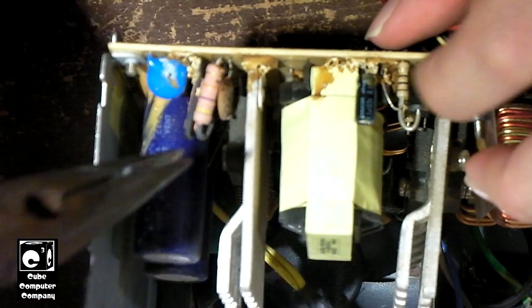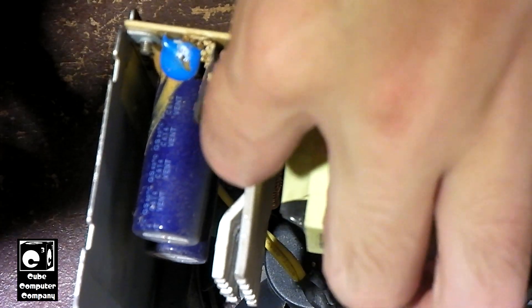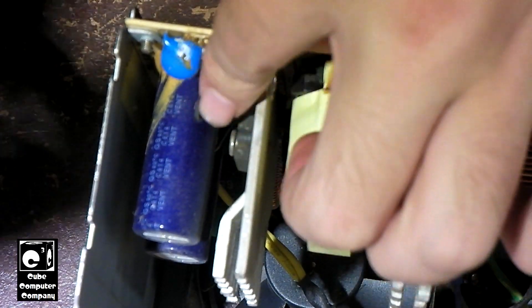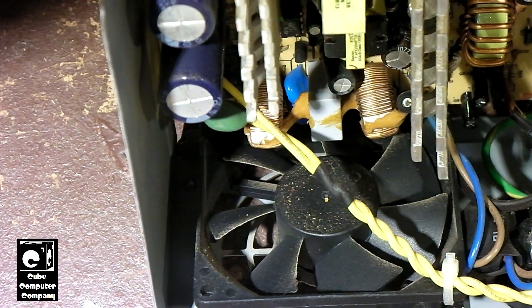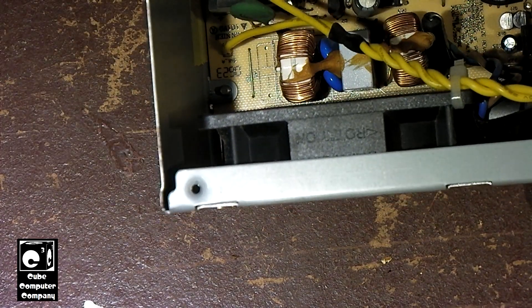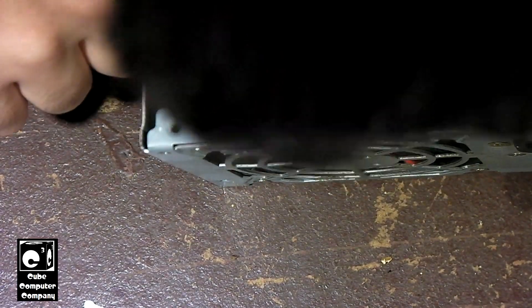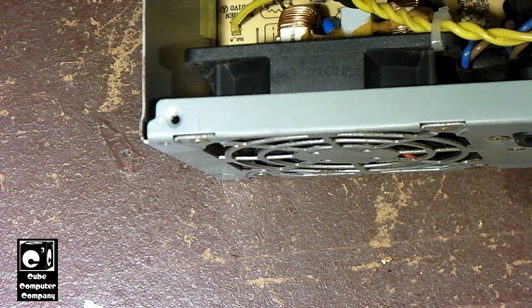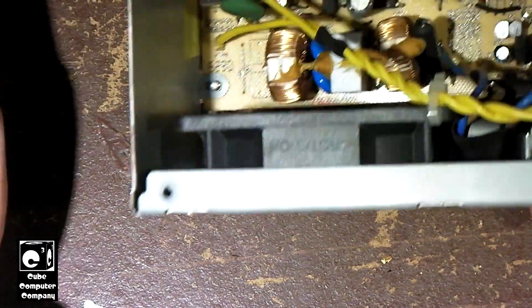Make sure you're not ripping out leads. In case y'all think this unit's bad, I've seen worse. I'm particularly mainly concerned about the glue areas around component leads, especially on the high voltage side — and this stuff can do some pretty nasty stuff. Anywhere where it's getting really dark, I'm going to try to get it out.